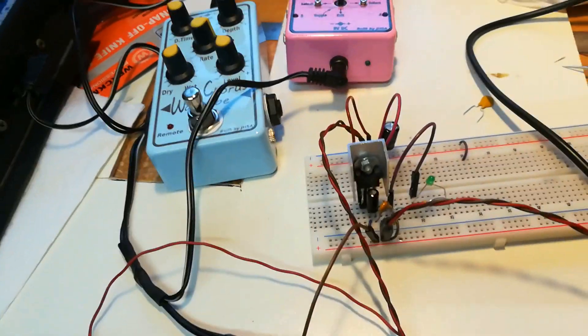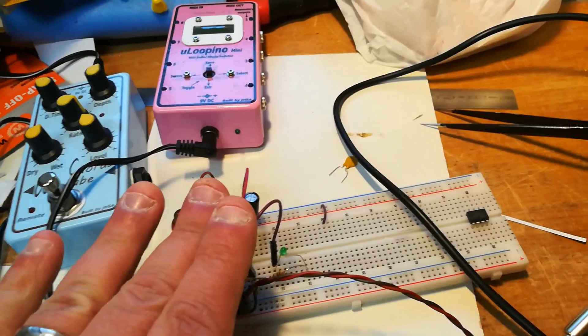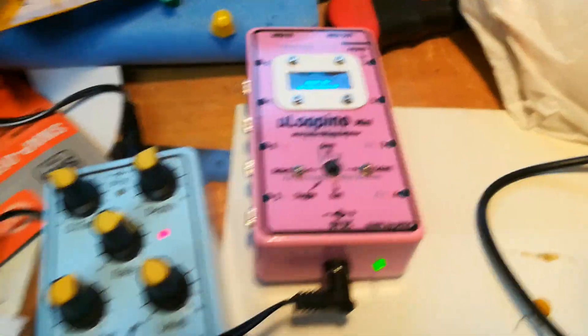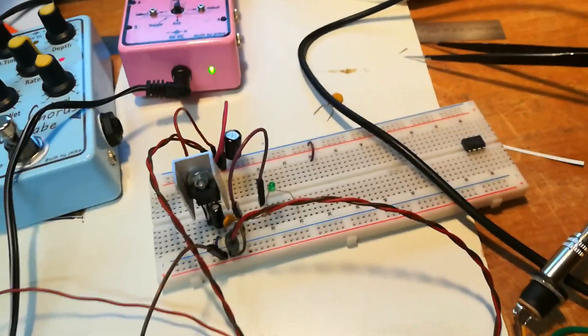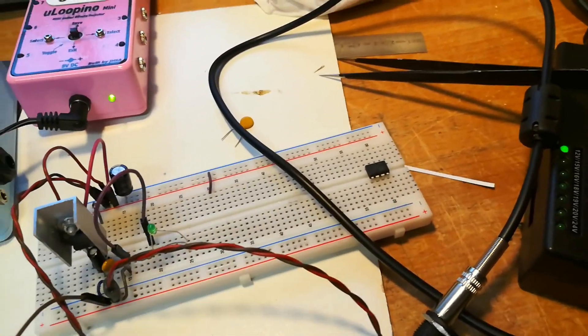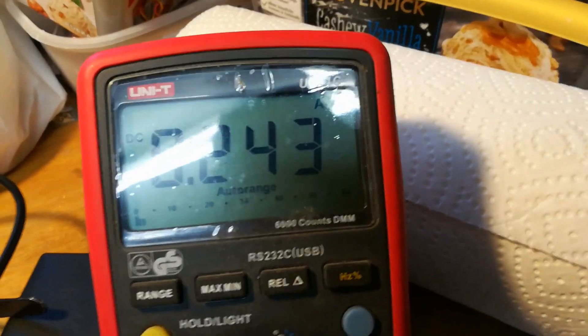The circuit hasn't fully recovered yet, so I'm going to turn it off for a moment. As you can see the ammeter is off — power is off. I'll wait a little bit until the PTC cools down, and then we'll see that power will be restored as soon as the polyfuse cools down. Turning it on now — and there you go, short circuit is cleared, power restored.